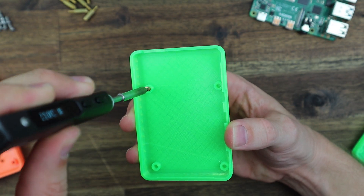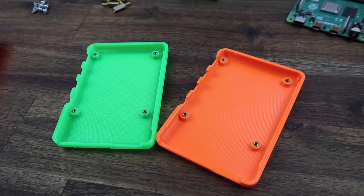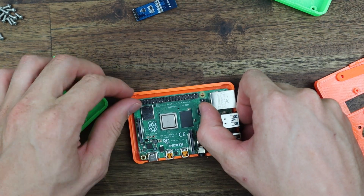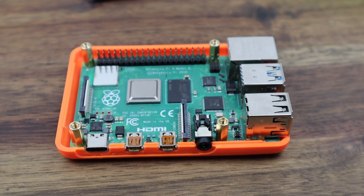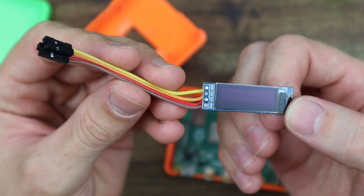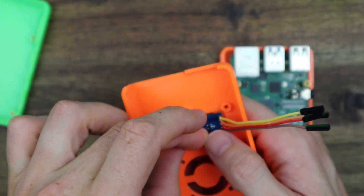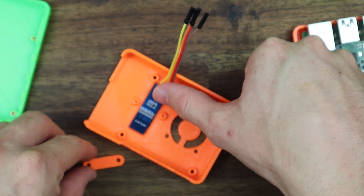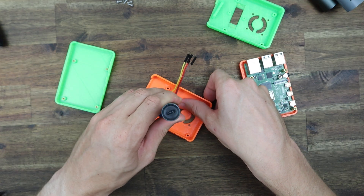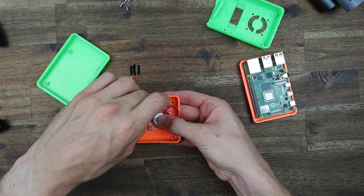I'm going to do the same for the PLA print while I've got it out. The power board is then held in place on the base using some M2.5 brass standoffs. On the case lid we can now add our display and our 30mm fan. I had to remove the header pins on the display so that it's compact enough to fit into the case — I just added a short lead directly to the pads on the PCB. The display is held in place using some M2.5 screws which hold a retaining clip around the back, screwing directly into the printed standoffs. The fan is held in place with some M2.5 button head screws and nuts on the inside.